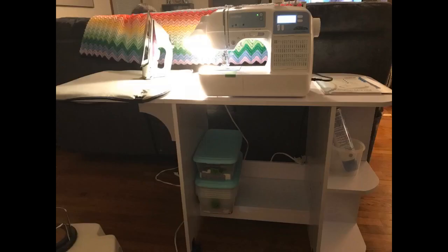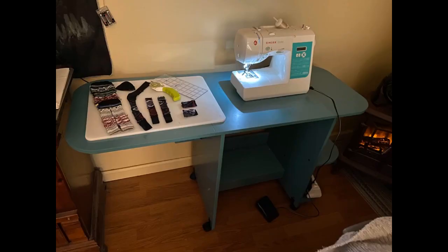The instructions are okay — basically just pictures and very few words. After assembling the top pieces, the next step is to build the side shelves section. Keep an eye out for piece J. If you assemble C, D, and J and then the side of the table won't fit onto them because the middle holes don't seem to line up, you have J upside down. When it's right, the holes line up just fine. Don't wait until the whole thing is together before figuring this out, like I did.